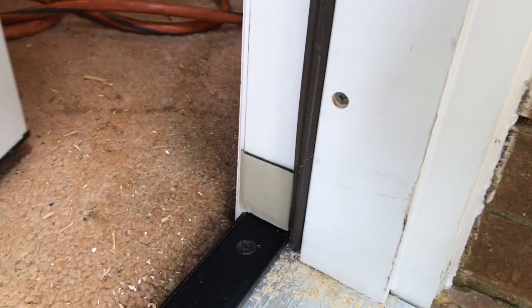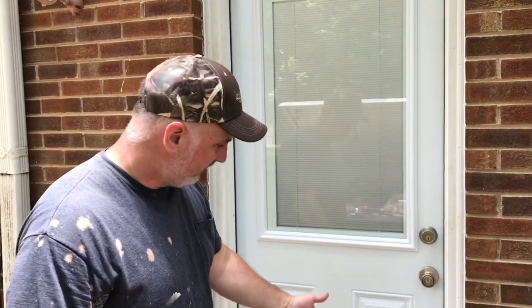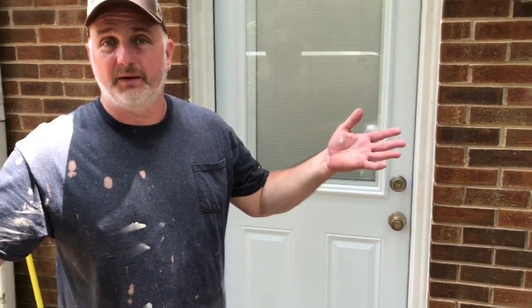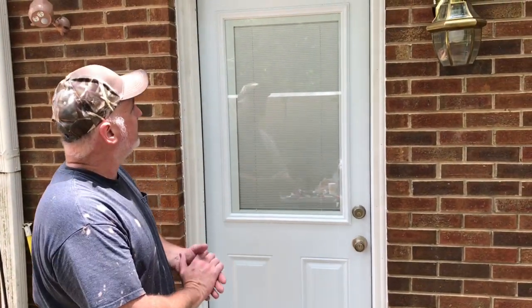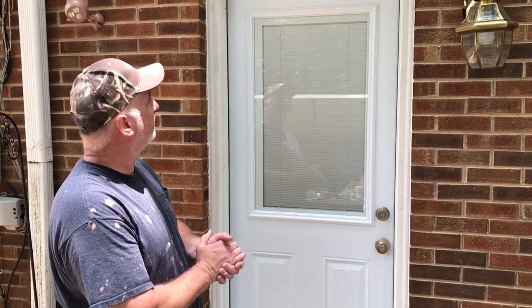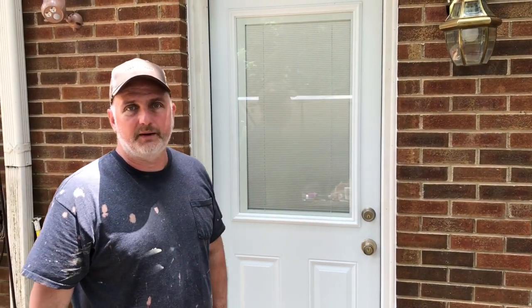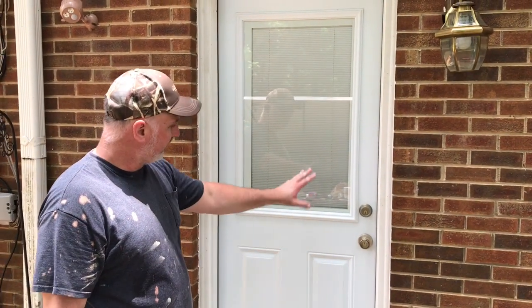All right guys, those are installed, and we went back in and checked, because we noticed before that there was just a little bit of daylight at the bottom of each door when you're inside looking out. You put those on there like the manufacturer recommends, and hey, guess what? The daylight goes away. Anyway, we've wrapped this up, guys. It's actually ready to have nail heads filled over with some painter's putty. We're not going to do that today. Everything's caulked up, so we'll get the painter's putty out, get some paint, and we'll be putting some paint on this brand new door.